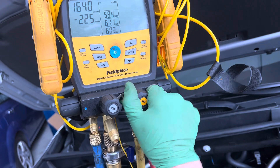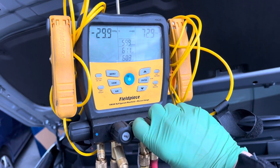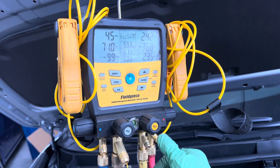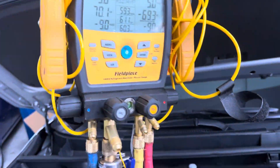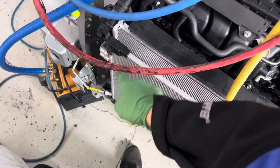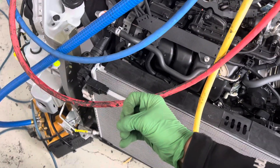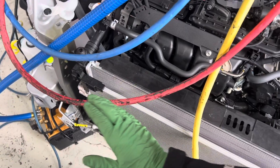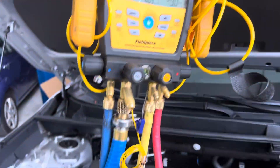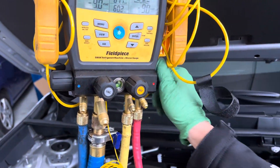Let's give it a little open, then a little close. You've seen it shot up — now it's positive pressure. That's what you want to see. When the technician takes off the line, instead of sucking in humid, moist, wet air into the system, there's dry nitrogen that'll slightly come out at a slight positive pressure.